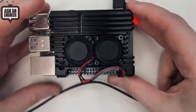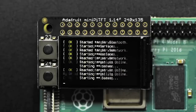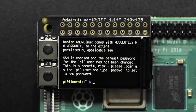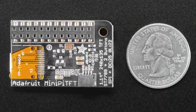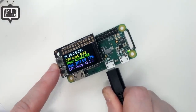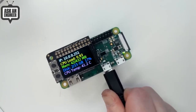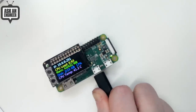The star of the show is the mini Pi TFT — a very adorable little screen. This is a 1.14-inch 240 by 135 IPS display, and the image quality is beautiful — it's not Photoshop, it's for real. There are two ways to use it: you can use it with Python directly, which does not require kernel drivers, using the Pillow library. You can actually play little videos on it — it's quite small but has good resolution and great full color.